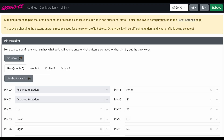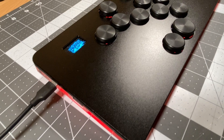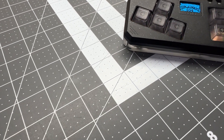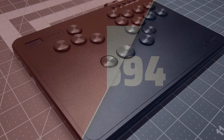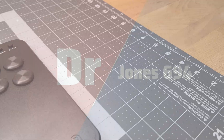Now you've seen all my screenshots. Everything's working fine for me — I've gone back in, changed settings, saved, rebooted, and had no issues. I do believe out of the factory, however the firmware is being pushed, that build is corrupted somehow and not being delivered properly. But when you get it yourself, this is a standard GP2040 controller — when you flash it yourself it works just fine. You can customize it again and again. Hope this helps, thanks for watching, bye.